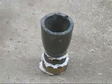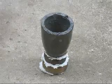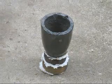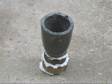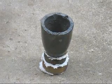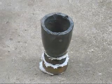Here is some interesting facts about the melt. I used an A3 clay graphite crucible. It holds about 2.8 kilograms of cast iron, and that took approximately 35 minutes to melt.